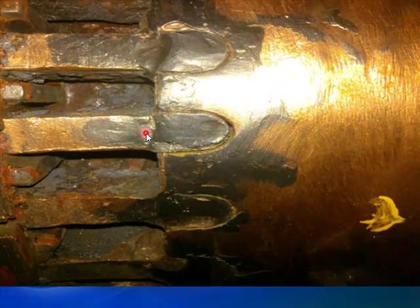Lo and behold — look at this. There is some serious air showing up between the rotor and the end ring. Panning over this rotor, we can see that this is an area that's supposed to be brazed, welded, or soldered so that conductivity between the end ring and the rotor bar is almost perfect. In this situation, we're seeing an air gap, loss of metal-to-metal contact — that's a high-resistance connection. It's going to create elevated current in the nearby bars, which will cause each next bar to work harder until it expands and breaks itself. In this case, we had six broken bars.